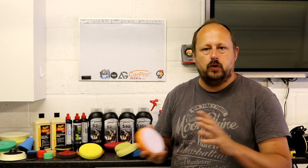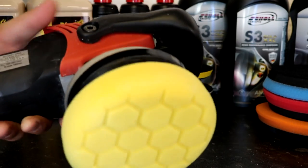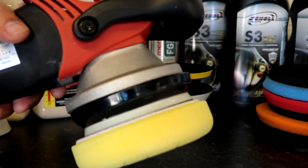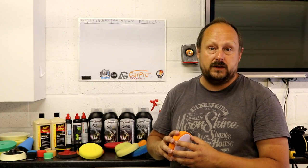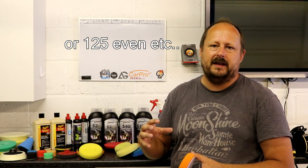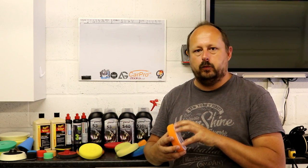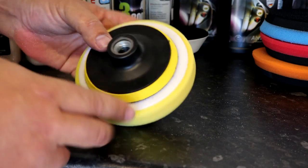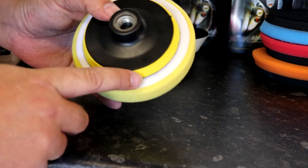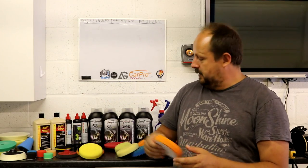Just be careful on the size - whenever you're buying pads, check the size of the pad and the size of the velcro fitment. These five-inch pads are listed as 125mm pads, but the velcro size on them is 110mm, and it's quite hard to find a plate that will fit that. If you go for the six-inch pad, it will have a 150mm velcro size which is much more standard. Make sure you've got a plate that will support the pad reasonably well - you don't want a massive gap between the edge of the pad and where the plate finishes.